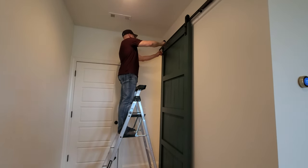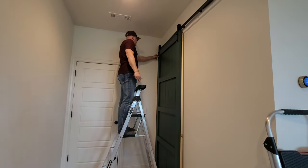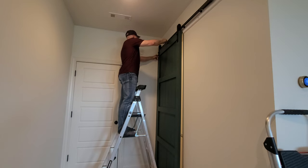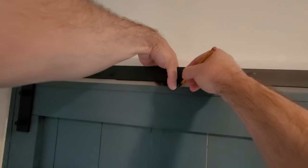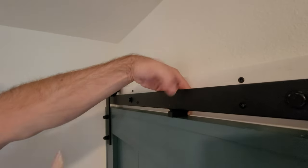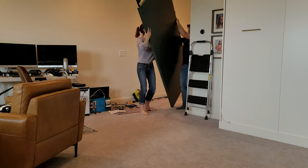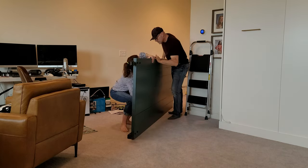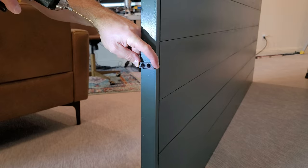For me, this was the trickiest part: figuring out where the actuator needs to be installed. The actuator gets attached to the top of the door — there is one for the left side soft close and one for the right side soft close. My husband held the actuator at the top of the door to see where it trips the soft close, then marked it with a pencil. Once it trips the soft close, that's when the door totally slows down. Once you've marked your two spots, take the door down and install the actuators.